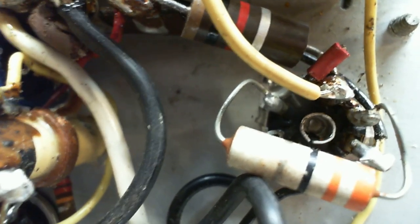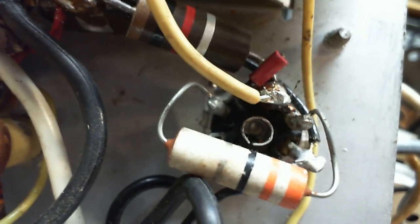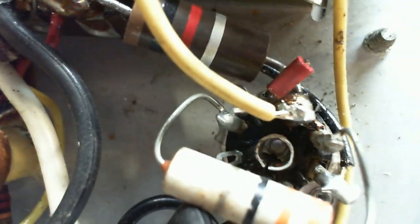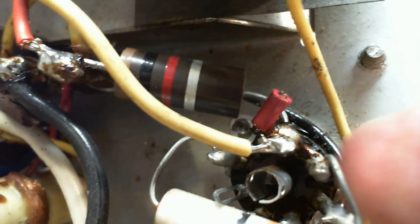That's a little odd. This is the rectifier tube here. How can you cut wires off the rectifier tube? Because you use this yellow one here, which goes right back to the, yeah. So what's happened is the capacitors come with different colored wires, the yellow one. And he could have used the technique I use, where one of the challenges here is keeping track of which terminal you're supposed to be hooking stuff up to while you're making component replacements. So when you cut a wire off, you don't cut it right off the terminal. You cut it back a little bit. Leave a little tidbit of it there, because look what it's saying: a red wire went here. And that can be helpful in the repair process. And maybe that's what that is, and he just didn't come back and clean up his tidbits.